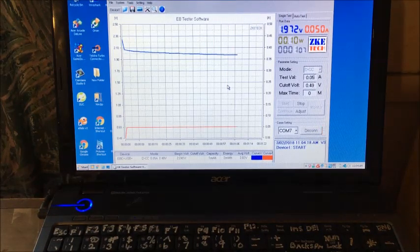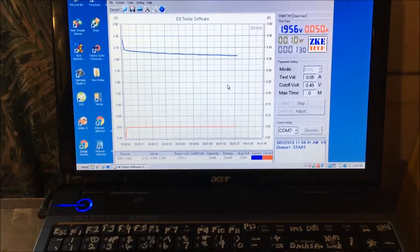So I've got a membrane drying at the moment. Wondering if we should do the 20 charges or we should just wrap it now and see the difference. But nah, I want to add the extra pieces to see if it adds to the power density as well. I want to add 3 more home carbons and 3 more manganese dioxide carbon sheets to the cell. That should theoretically take it to 120 milliwatt hours maybe, only guessing. But it's 3 extra sheets both sides. That's if it is accumulative. Alright, I'll let this one do its thing and I'll get back.